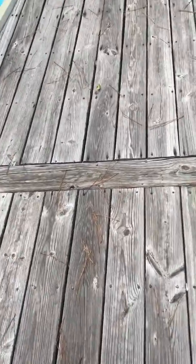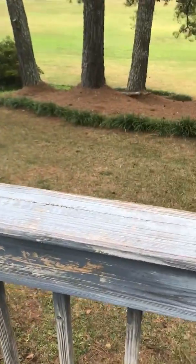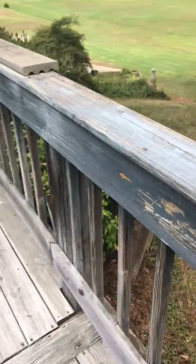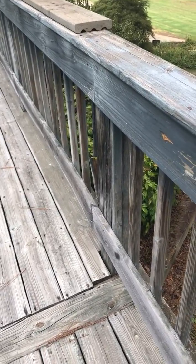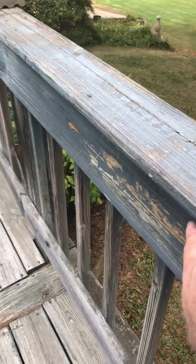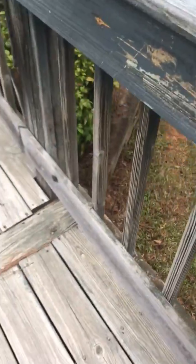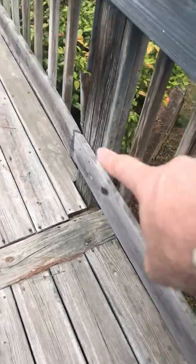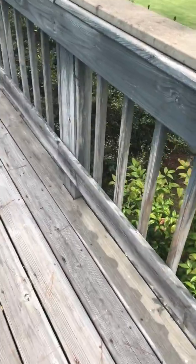You can see where it goes bad. All of his railing is in pretty good shape — the top board on his rail all the way around, this top five-quarter board, is in good shape, so we'll leave that all the way around. But the actual top cap we'll replace, and we'll replace the bottom boards down here — a lot of these are warped and miscut all the way around. The posts are all in great shape so we don't have to do anything with those.